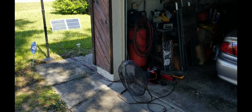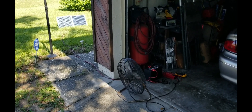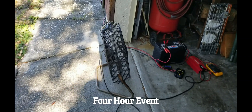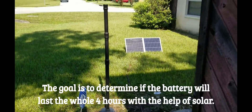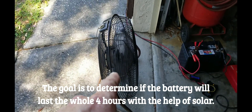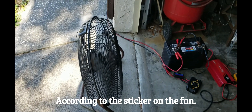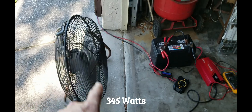Good morning, playing with my solar today. I got a real-world chance to use it — we have a community day at my church outside next Saturday and my wife says it would be nice to have a fan. There's no electricity out there, so I've got my 250-watt panels out to test with one 12-volt battery and this fan. This fan pulls 2.9 amps — might as well say three — so you times that by 115, and that tells me the wattage it pulls.